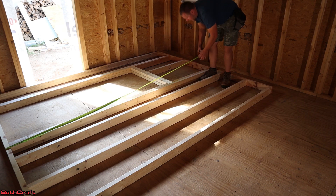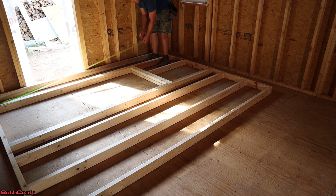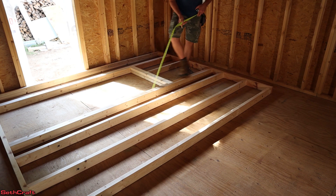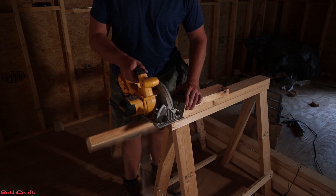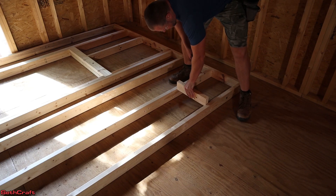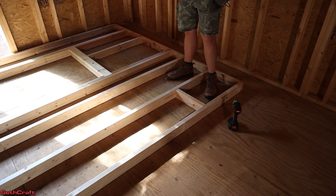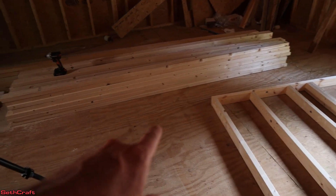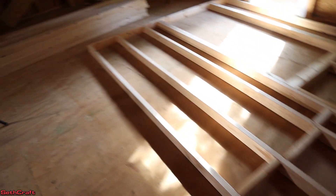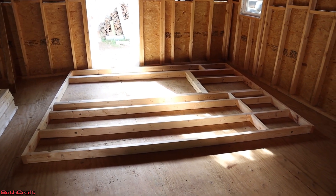The reason I'm only doing eight foot is because my neighbor has some plywood that he's going to sell me. So I'm going to be doing plywood walls instead of sheet rock, which will make this building very heavy, but also I can mount anything to the walls because it will be so strong compared to sheet rock. I'll be hanging eight-foot pieces of that plywood here all the way from the ground up to the eight-foot mark. To install the blocking, I just need to figure out my distance here — this is going to be 13 and five-eighths. I'm going to stagger my board and continue on the line until I have the rest of these done. My next step is to build an 80-inch wall over here and they will be connected together through the middle.